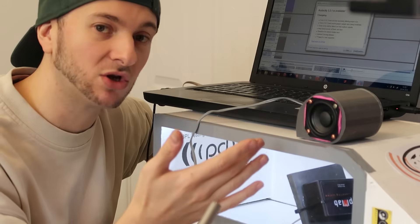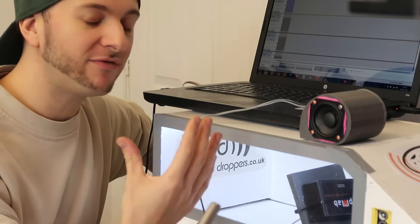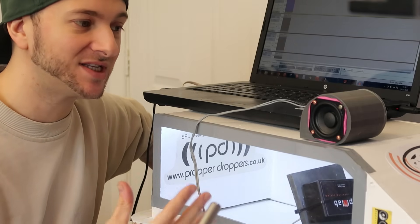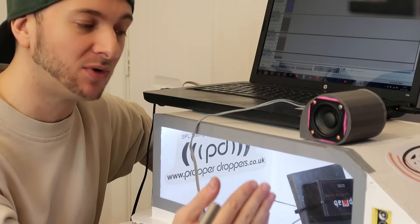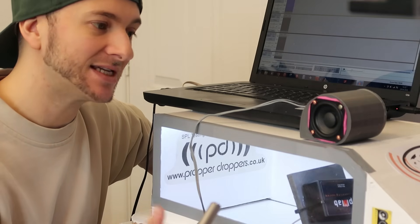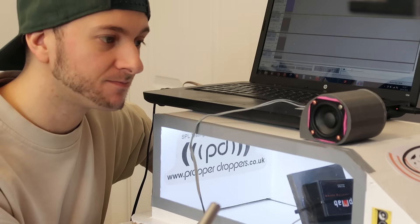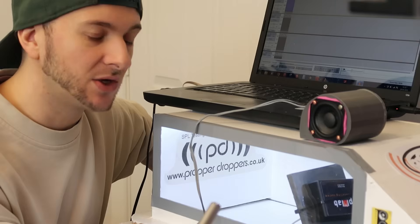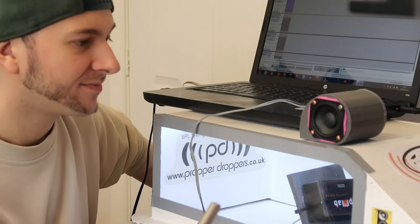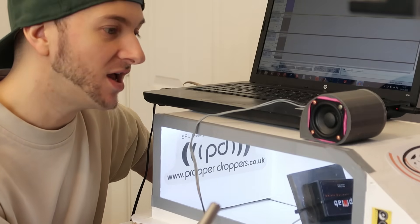If you push it in and it comes straight back out and it's very soft, you've got a big air leak somewhere and you need to seal it. Because this is a sealed box, we're going to be listening to waveforms only coming off the driver — we're not loading a quarter wave line or a Helmholtz resonator or port or anything like that. Naturally, the more the cone moves, the more distortions we're going to introduce, because as this runs past X-Max, we're going to get non-linear excursion BL. It sounds okay at this volume level, but there are harmonics now — a fair bit — loads and loads of harmonics. That's literally just us pushing the mechanical limits of the driver too far and introducing a bunch of distortion.